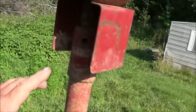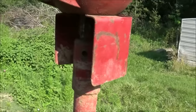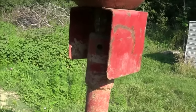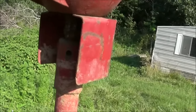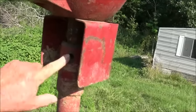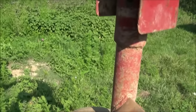And you always keep those around. They're called shear pins. Well, we call them shear pins, but they're just nuts and bolts. But you always keep them around because you never know when you're going to shear one of them off. And they're there for that reason, not just to hold this bit on, this auger. They're actually there to shear off, too. And, of course, it's sheared off. I saw it when it snapped.